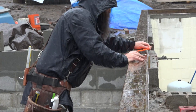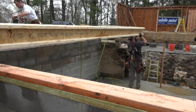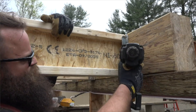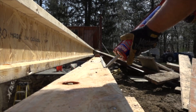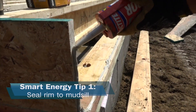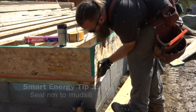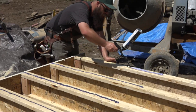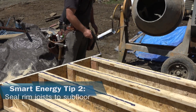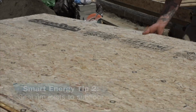A few steady days of rain set us back again, but Ben showed up anyway to lay out the floor frame. One critical place for air sealing is the floor frame assembly, because everywhere that two materials join is a gap that will leak unless it is sealed. Ben seals the rim joist to the mud sill with adhesive, and then seals the corners, bedding the rim in glue. Subfloor adhesive is sometimes left off at the perimeter because the floor won't squeak under exterior walls, but that creates one of those continuous gaps that leak — so Ben hits the perimeter before adding subfloor.